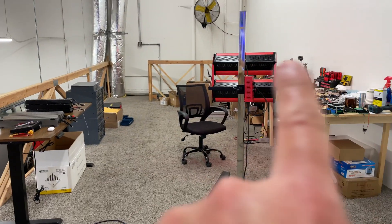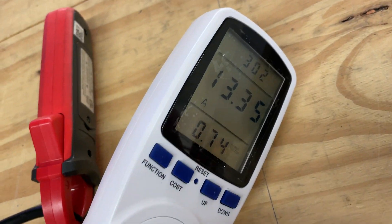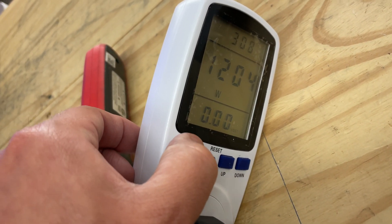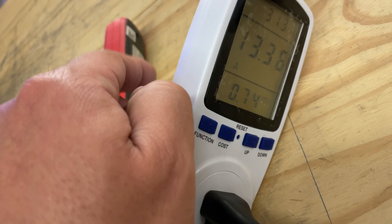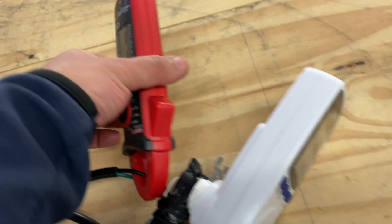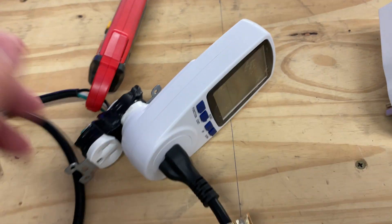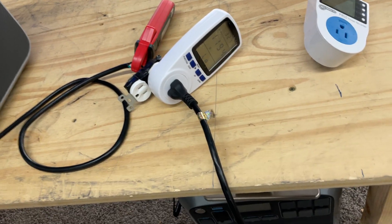The load is a heater over there that is quite a bit — 13 amps at 120 volts. If you do the math, 13 at 120 — and it's actually 13.3 — so it matches. That's about 1500 watts.